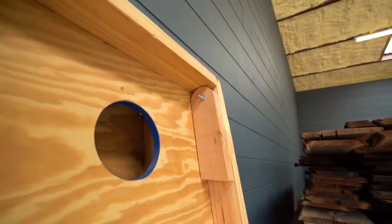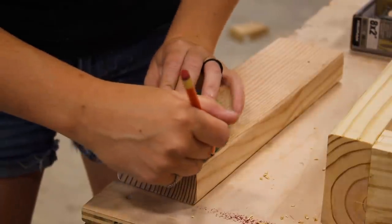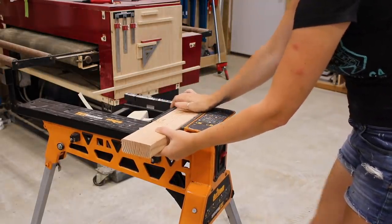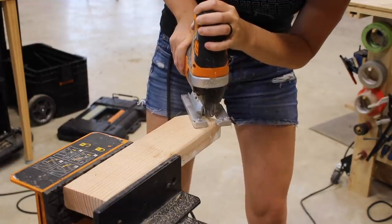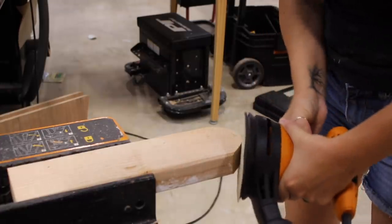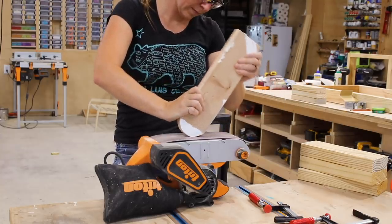The legs are attached to the inside and then rotate up into the body when being stored, then down to prop the board up to be used. Grab anything you have with a diameter about the size of your board so that you can trace the curves on the top. I stuck my legs into my Super Jaws, then used a jigsaw to cut the corners off and make them round. To smooth things out, I clamped a belt sander upside down on my workbench and quickly cleaned it up by rotating it against the belt.